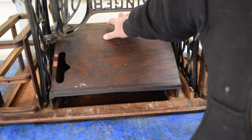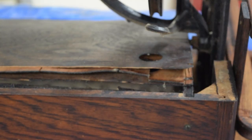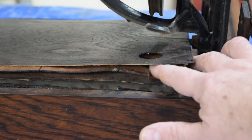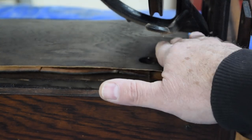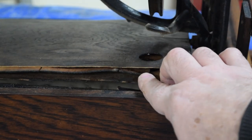The back of the cradle has some issues. Let's flip the table around and take a look at that. You're looking at the back of the cradle now. You can see we have delamination of the plywood. We have some missing substrate in the plywood. That's not all that unusual, and we'll be able to repair that with some careful work.